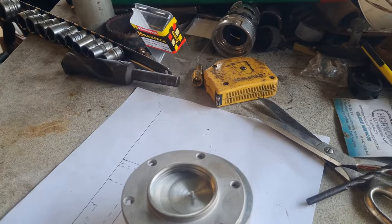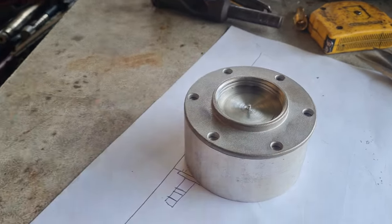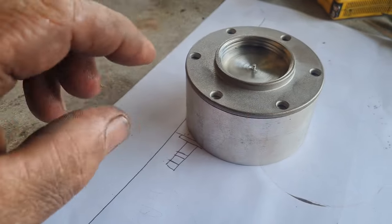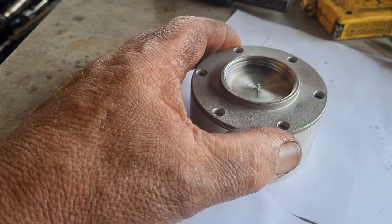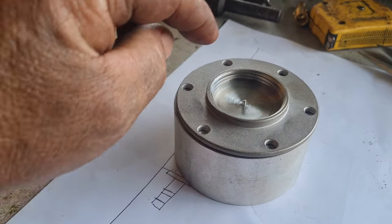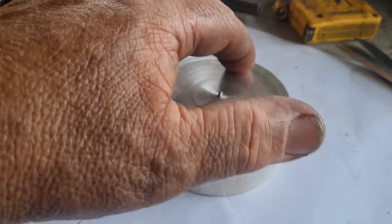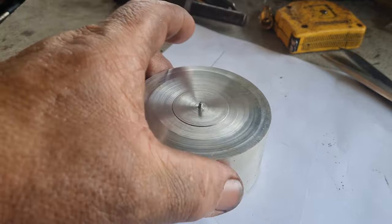It's a little too noisy up in the shed to do any talking, so I've come back down to the house. My plan here is I'm just going to set this on top here. I'll clamp that in the vise, clamp these together so that it's held solid, and get the hand drill and mark out each hole with the hand drill. Then I'll bring this down with the markings on there, and that'll give me a pilot to drill all the way through.